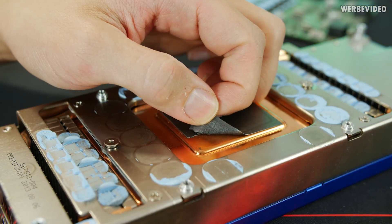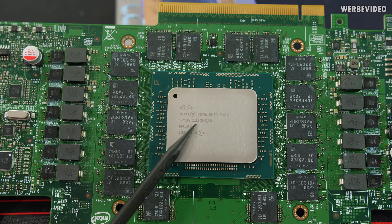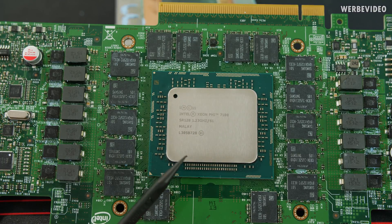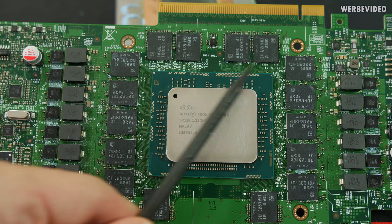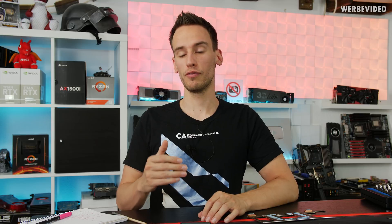There we have the coprocessor in the center - Xeon Phi 7100 with 1.23 GHz / 61 cores. Also an interesting design with a small IHS in the center and quite a big substrate or PCB around it with a lot of SMD caps. This 61-core CPU has 244 threads. Normally a Core i9-10900K with 10 cores has 20 threads - double the cores with hyper-threading. On the Xeon Phi you have four times the thread count versus core count, which reflects what these are designed for: a massive amount of threads with lower performance per core. For gaming this would absolutely not work.